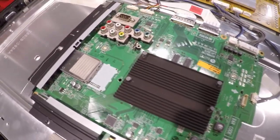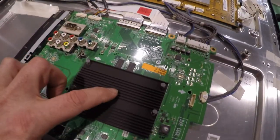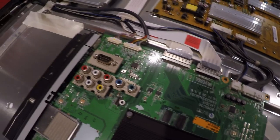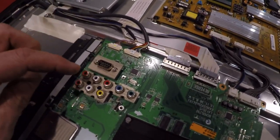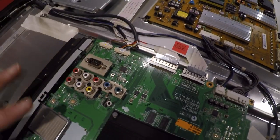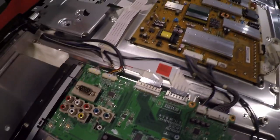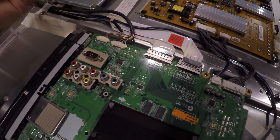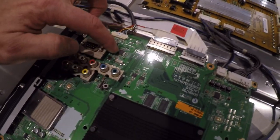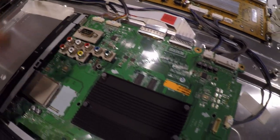But as I did more and more internet searching, I found out — I'm going to take this off and show you. Over here is a small microprocessor and it kind of controls the activity on the board. It doesn't do much with the video, but it handles the front panel buttons and the remote control. And the buttons were actually working — it would turn on and off with the button and the little red LED would come on. So this little guy was interpreting the signals, but we wouldn't get anything on the panel or the video.